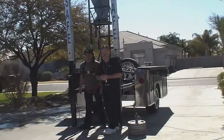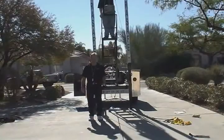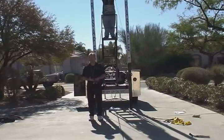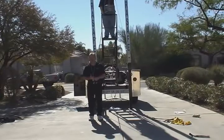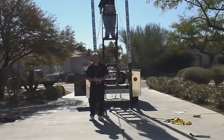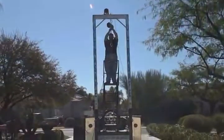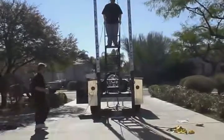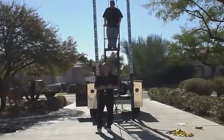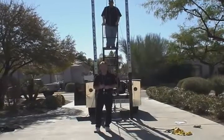Let's do another test run at a higher height using our test weights. We're going to perform a test drop now with a 220-pound rigid test weight to simulate what would happen in a tower crane or windmill emergency situation — what the speed of drop would be if someone had to self-rappel. You saw a nice controlled drop. This will handle up to 500 feet of rope, which would handle most situations as far as the highest tower cranes or windmills in the country.